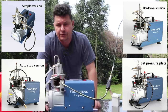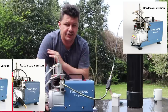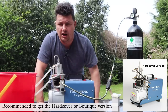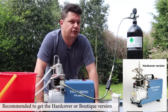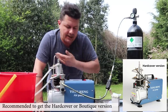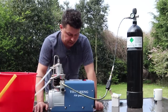The next version is what they call the auto cutoff — when it hits 300 bar it will shut off. I don't recommend you get one of those. The main reason is you should never be leaving these unattended ever. The fourth one is their deluxe version, which they call the custom cutoff, where you can set the actual pressure you want it to switch off at. I don't see the point in spending the extra money on that either, for the safety reasons I'll explain later.